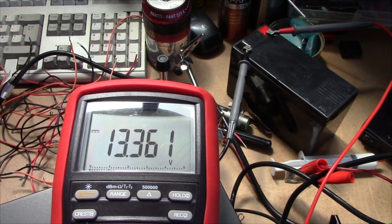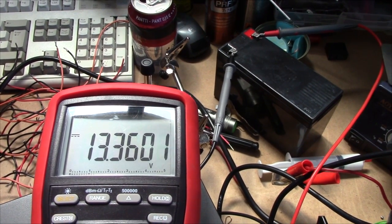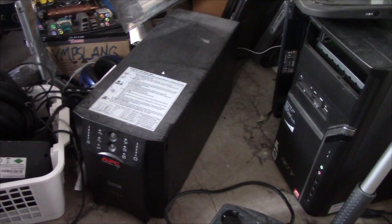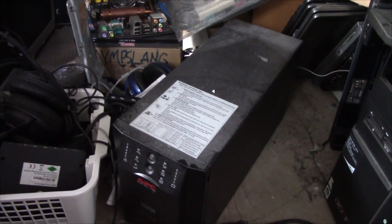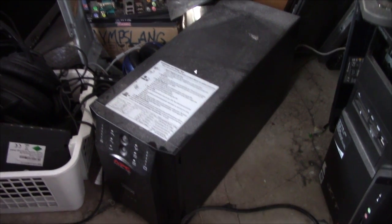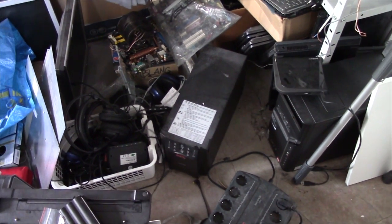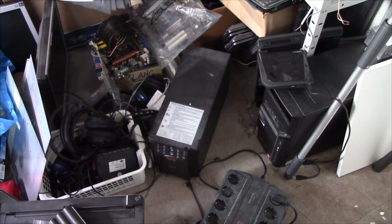As for the battery with the suspected shorted cell, I left it charging overnight and took it off the charger just a moment ago — it looks alright. It should drop down to about the same level as the other ones. It goes to show how little track I keep of my UPS units, because I dug this thing out to get started and I thought it was a 1000VA unit, but it's actually a 1500VA unit which takes the 17Ah batteries that are still charging. I'm going to have to try another unit — I was absolutely convinced this thing standing in the middle of the floor for a few months was a 1000VA unit. It's not a bad thing that it's 1500VA, but it's not what I expected.